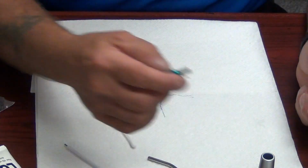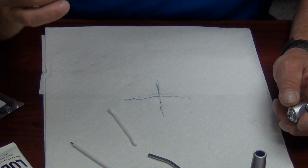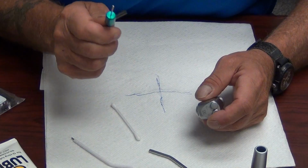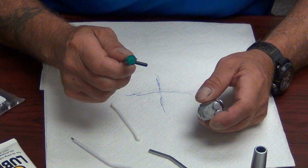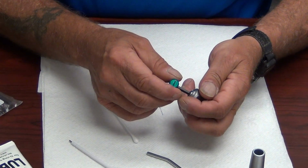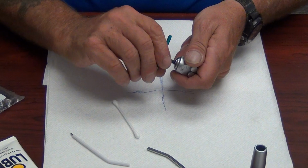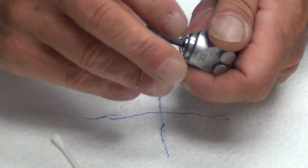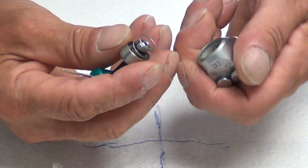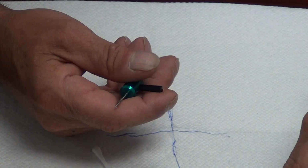We will get our syringe tool, which is available from DCI. It's part number 9287. This is an indispensable syringe tool, guys. You really need this. With the Allen wrench attachment on the front, we're going to remove the tip holder. Counterclockwise, we're going to unscrew very gently and set the tip holder aside with the retainer spring.